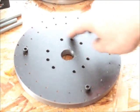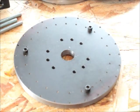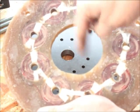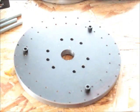So that's those dimensions there. That's one inch, three inch diameter. Three inch diameter is also important because the stator coils are going to go on the inside of this, and that is three and a half inches, which is my stator. I'll talk about the stator later.